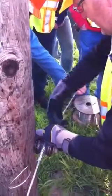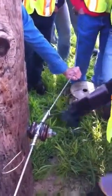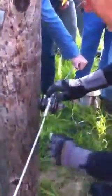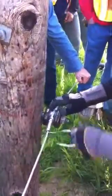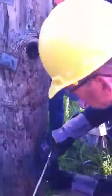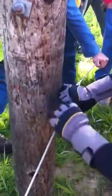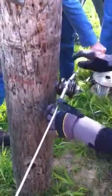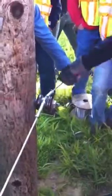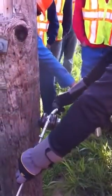I'm not going to waste it. In this case, I'm going to bend these tails back on themselves. At the school here, we're going to continue to untie them and put them back on and do different jobs. Some places in the world will tie them back just like that too — it gives you something to hook to. If you're going to untie them later, it gives you a place to grab and pull it off, or if we're using a hot stick from a distance, it gives you a place to hook it and pull it back.